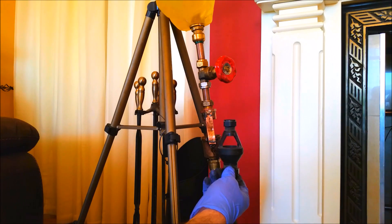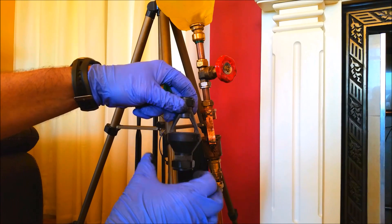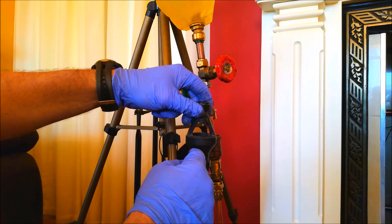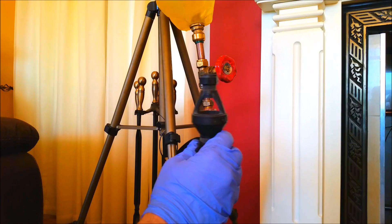That essentially fits there, and what happens is the oil drips into this and you can see the drips. You can actually see the flow rate of the oil as it travels by here, because if it goes by here it's heading into the stove, and you can see what your stove is getting. So that's a tundish.